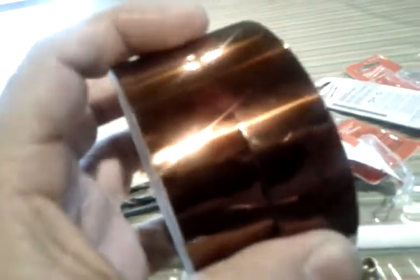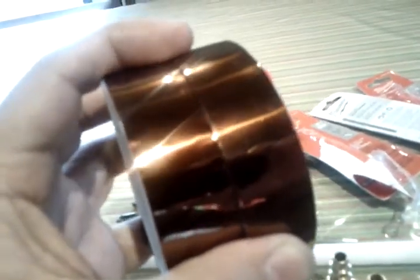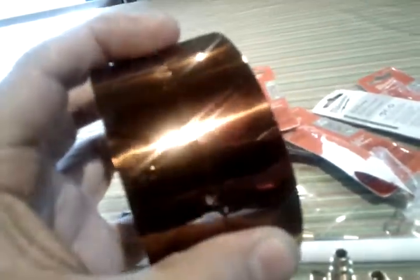You'll need a little tiny set screw that goes into the front of the block and locks in the brass coupling. The brass coupling has a little bit of heat sink compound applied to improve the heat transfer. You'll need some Kapton tape both to protect the thermistor and to secure the resistor and insulate the hot end heater block.